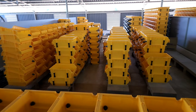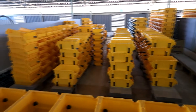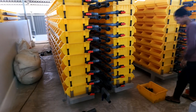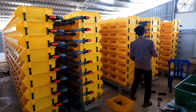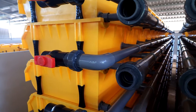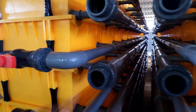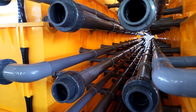This is a bit different with the boxes from PISB because you can actually modify the requirements according to the type of flow that you want. This is because most of the piping is actually located in the back section of the boxes. So what we have for this newer setup is we have increased the outlet size to about one-and-a-half inch and the inlet is going in at about one inch. This is to maximize the amount of flow going in and out of the boxes to keep our crabs healthy.